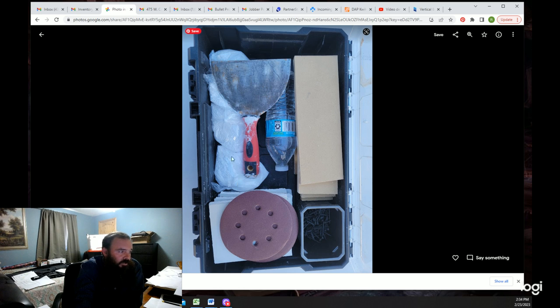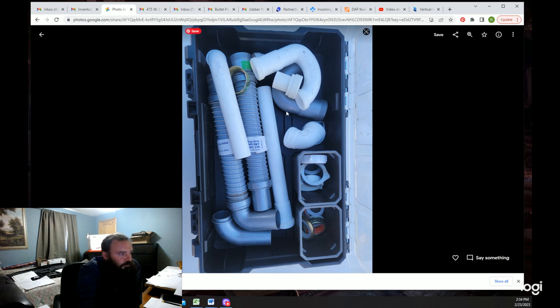This is my medium patch and paint kit. These are bags of hot mud — I keep them in Ziploc bags — plus sandpaper and pieces of half-inch sheetrock. The drywall screws should be inch-and-five-eighths. These are my backer boards that go behind the hole — always half-inch MDF, because that stuff grabs the screw hard enough to countersink it into the sheetrock instead of pulling through the back.